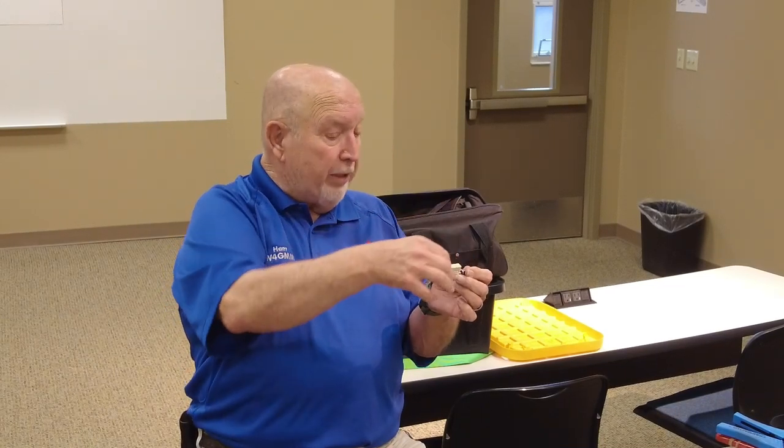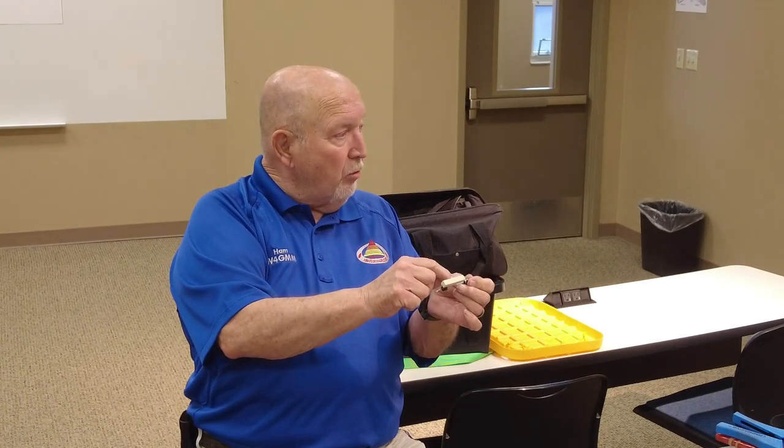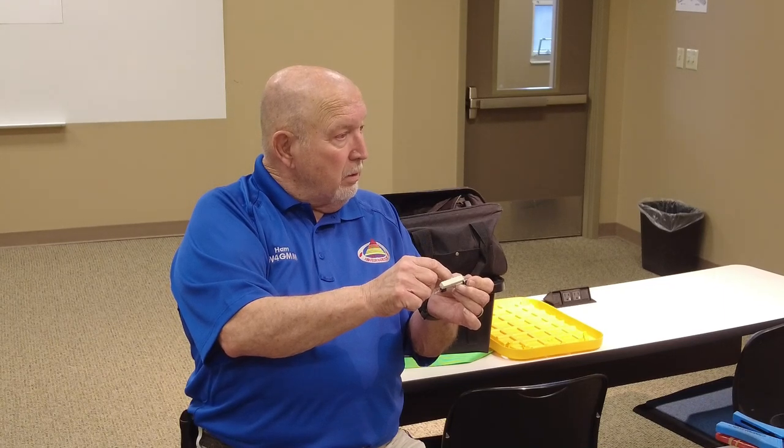So when you lose 12 volts here, now the battery comes back, and this diode is also protecting the battery to have the full 12 volt current. So when you've got 12 volts here, the only place you can go to charge a battery is through this resistor. Now when that voltage is gone, it's a straight shot back to your load from the battery. And it's done, like I say, it's done automatic.